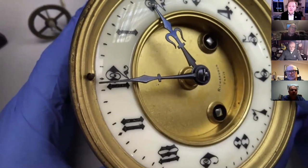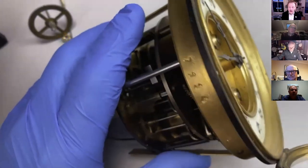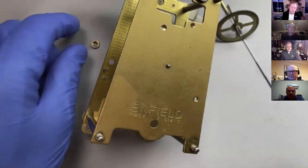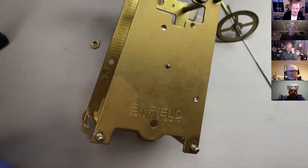There we are. You can see that. So it's about 15, 20 seconds too early. So I will just take it apart again, not now, and adjust that a little bit more. But it's quite interesting because when you're making those adjustments, I timed that clock striking 10, and it takes about 20 seconds to strike 10, the whole thing. So what's really nice, if you've got a choice of it striking after or before, is that maybe it wants to strike a handful of seconds before. So by the time the owner hears it and looks up, the clock is bang on the hour. If that's a choice, maybe it should go exactly on the hour, but that would be my choice rather than it already passed.